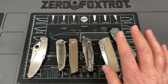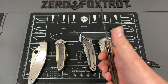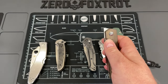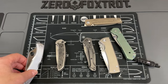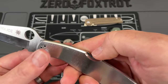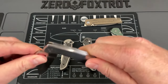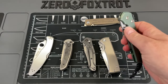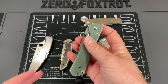What that allowed them to do was have a very easy process to make the lock. Back in the day, if you didn't have a liner lock, your other option was a back lock — and that was not one-handed open and close. A lot of them were one-handed open, like Spydercos — you could one-hand open the knife, but you had to two-hand close it. The liner lock allowed you to single-handedly open and close the knife. So now you had a strong lock with single-hand operation.